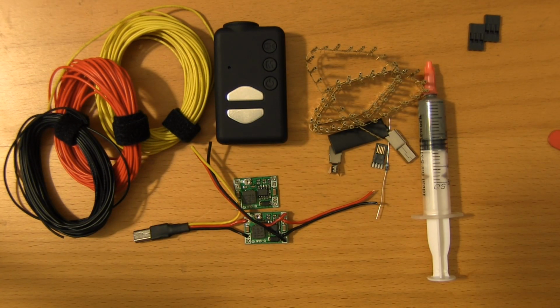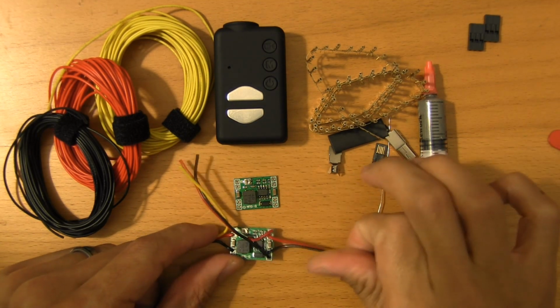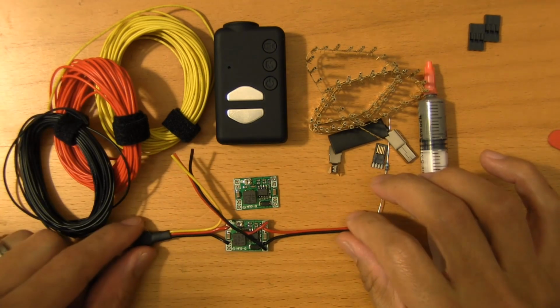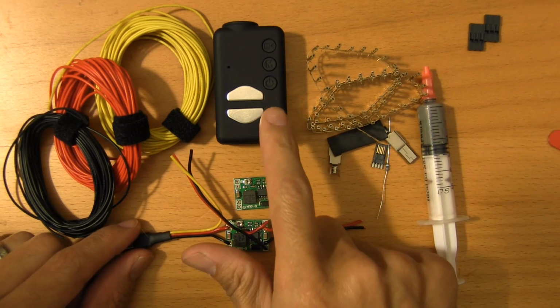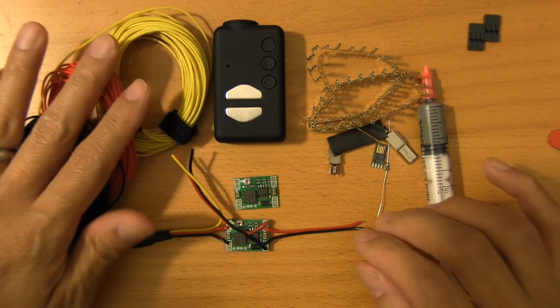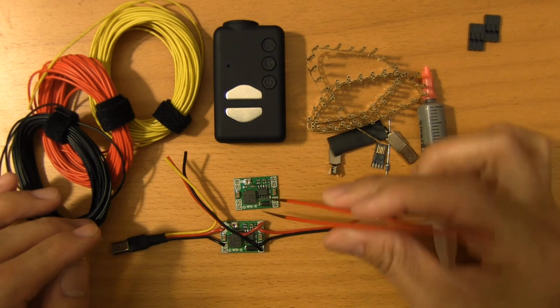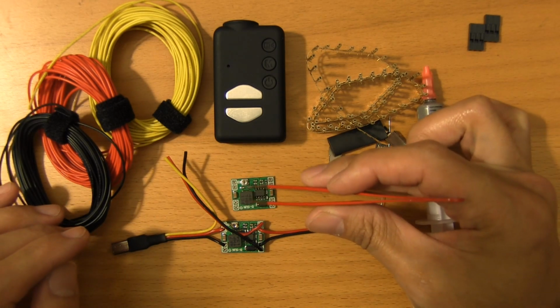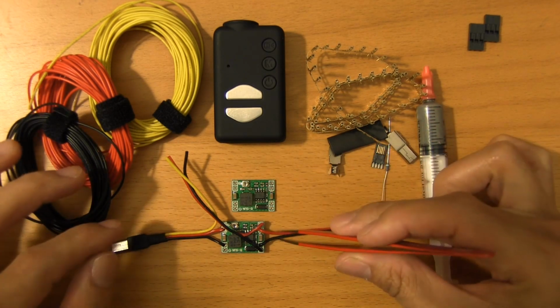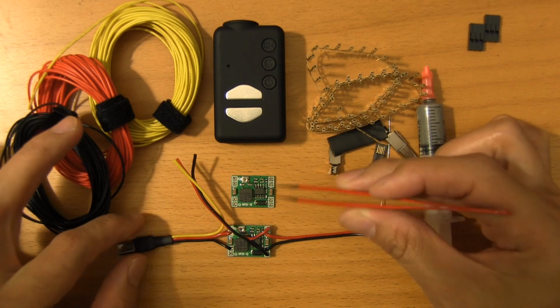So that's problem one. Problem two is, what are you going to do with a 16 volt or 12 volt power supply? You obviously cannot feed that into the Mobius directly, or you'll end up burning it out. So you need to step it down, and that's where this component comes in. This is actually a really great find. I've been hearing about these on the boards for a while, but only just recently started to find some reliable sources for them.